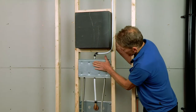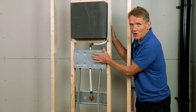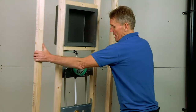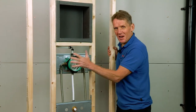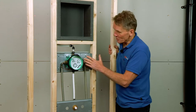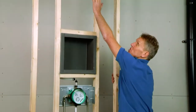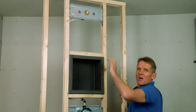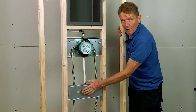You can see that this is all mounted on plates — these are part of the Abacus solution because you've got a really solid, adjustable fixing for a shower valve. In this case we're using a Hansgrohe iBox, which means you can put any one of around 100 different shower valves into that fitting — plug and play, if you like. The important thing is you've got this plate in there as a really rigid fitting, and that goes up to another plate for the shower head, which is also really secure, so you don't get any wobble or potential leaks.